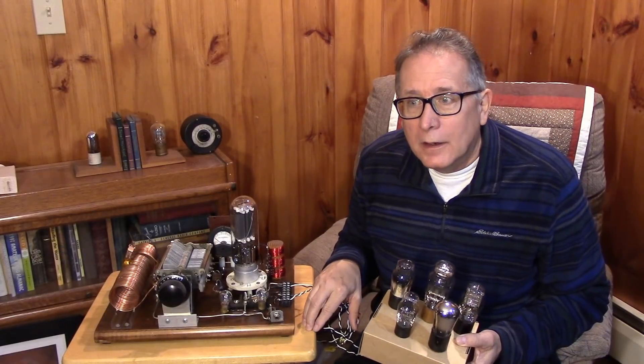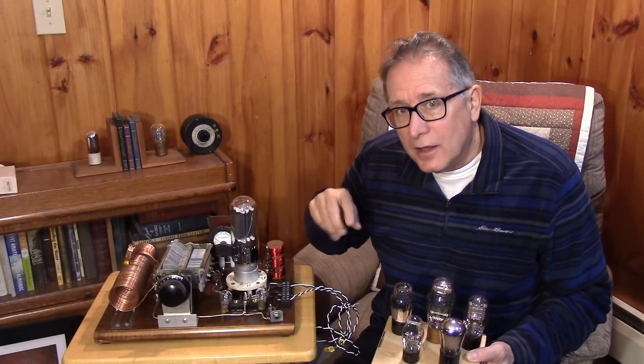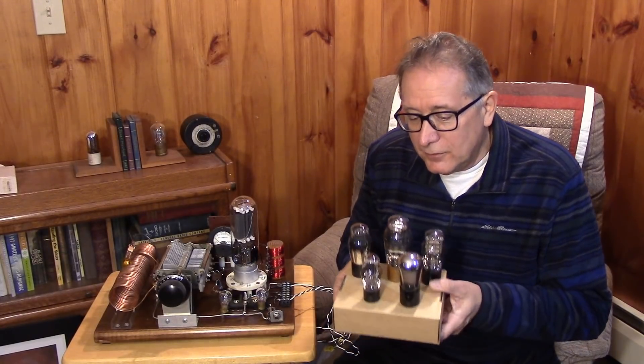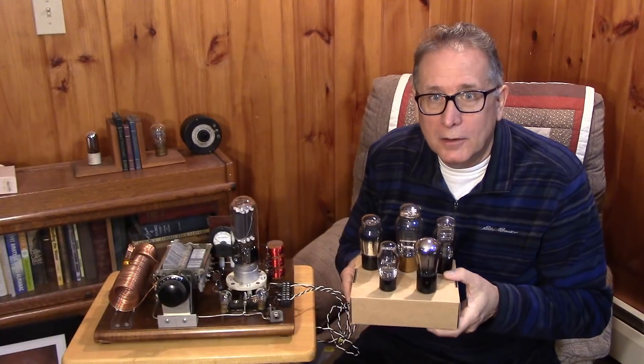Getting your attention with this big transmitter, you may be wondering what kind of power you're allowed to use in the contest: 25 watts or less input power. Generally, with a one-tube type system, you're probably going to get something around maybe 10 watts if the wind is right. And if it's a MOPA — master oscillator driving a power amplifier — you might get maybe 17 or 18 watts out with 25 watts of input power. Generally people don't run that high a power in this contest, though. Usually they're using a one- or two-tube transmitter with a much smaller tube.